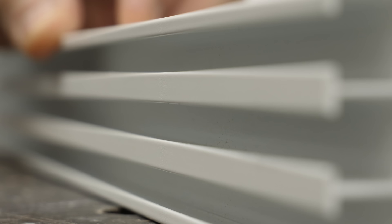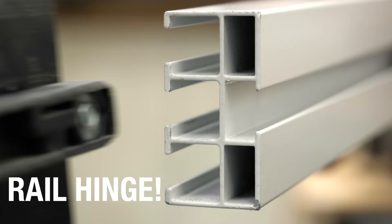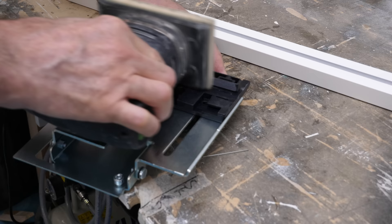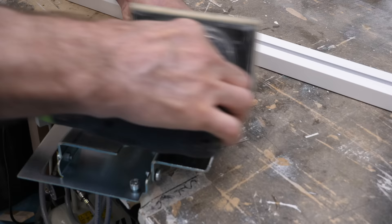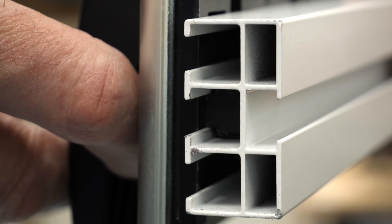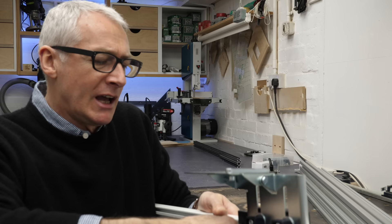The three slots at the front are just under 8 mil — at 7.8 mil or thereabouts — so they will take a T-bolt just about. When it comes to the Festool OEM parts, the rails don't quite fit without a little bit of adjustment; I spent a little time with a sander thinning this down slightly, and then it actually fits in there just fine. The disadvantage of the thin walls is that you really do have to tighten it up a lot to stop it from sliding, but once tightened it's pretty solid.